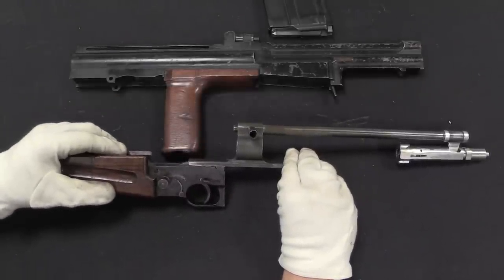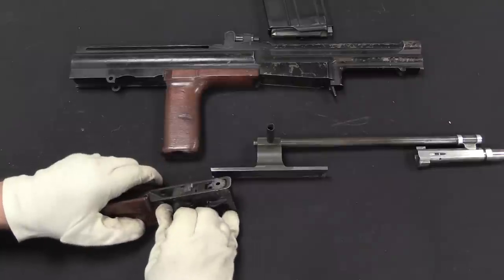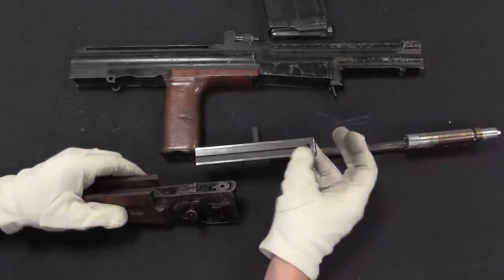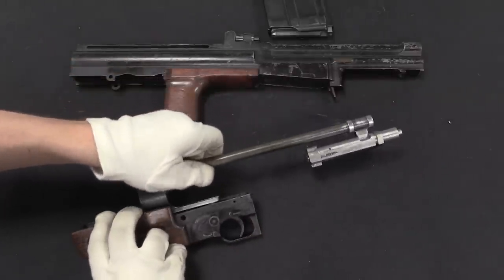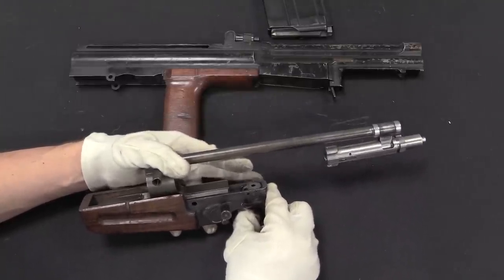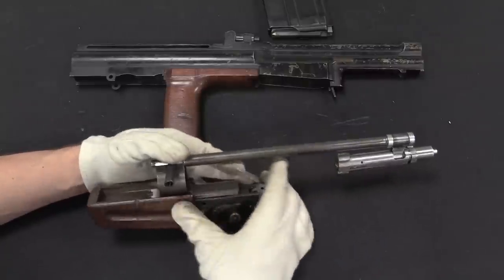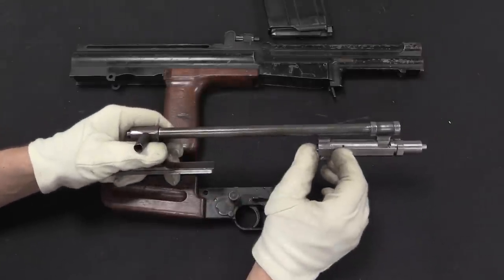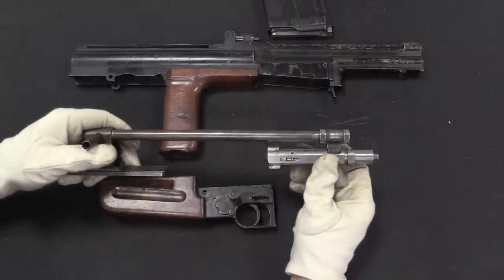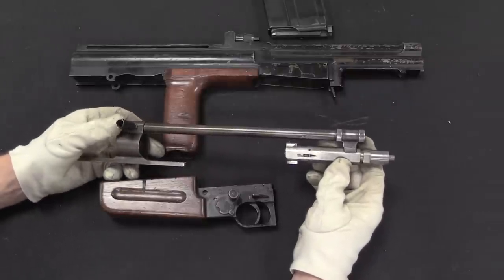In the semi-auto mode, or in the full-auto mode, you can see that the sear is hooking on the front of this bar. When I pull the trigger, that sear drops and allows the bar past. If we switch to semi-auto mode, we have now lifted up the semi-auto sear, which is going to catch in this track. That track allows the bolt to come almost all the way closed before it drops and allows the last bit of forward travel. They did find in testing that in semi-auto, this gun wouldn't reliably fire — there just wasn't quite enough spring pressure left in that little bit of forward travel to actually set off a primer. It did work well in full-auto, because in full-auto you're starting way back and have a lot of time to build up full momentum from the spring being fully compressed. So it may have been partly that which led them to scrapping this project in favour of what would become the other EM-1 and then the EM-2 rifle.